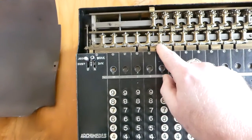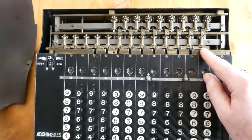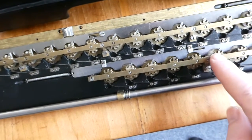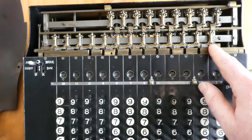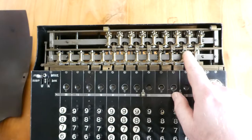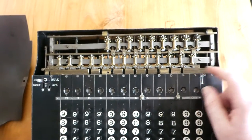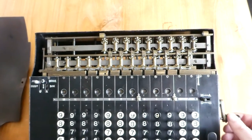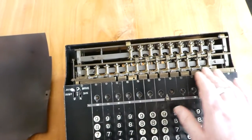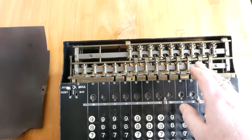You also see here these small switches — those are the carry mechanism. Each wheel in the register has a small pin pointing out, and that pushes this little switch, which triggers the carry mechanism and ensures that the next one up will turn one step extra. So if this one is triggered you see this one move one step, and then this is reset. The timing of each of these is sequential, so that a carry in the lowest digit will carry over before the carry for the next one is executed.